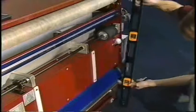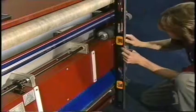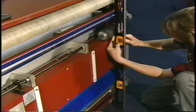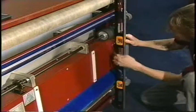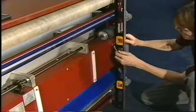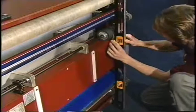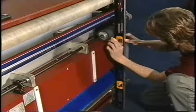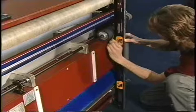Place the level lightly against the lane distance wheel and the blades of the squeegee. What we are looking for is the gap that lies between the drive wheel and the flat base of the level. As a starting point, that should be one hundred and twenty-five thousandths, or an eighth of an inch, equally on left and right side. We will simply slip the feeler gauges inside — and that is pretty close.